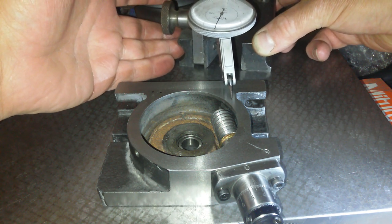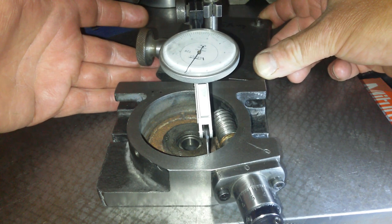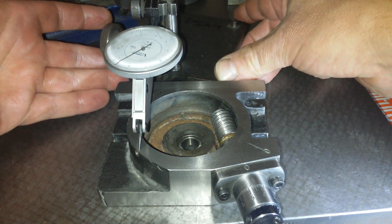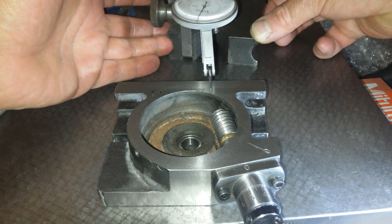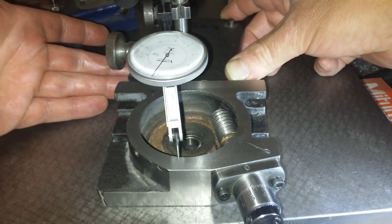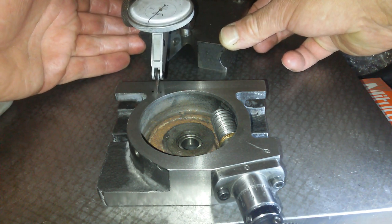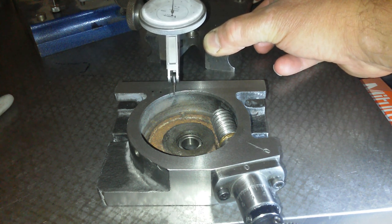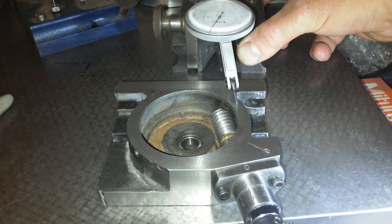No, that was just me doing something. I think I'm getting oil, dragging oil or grease around with it. Yeah, I've just done something. I've just touched something. So there's a bit of a dip there where the two marks are. But there. That's a 10,000th of an inch indicator, each division is. And I wasn't moving any more than four of those divisions. So that's pretty accurate.